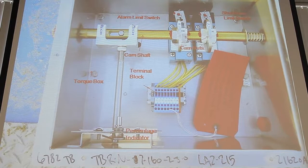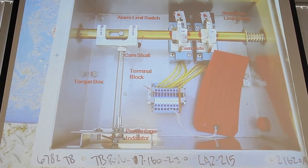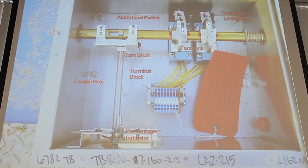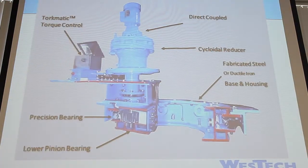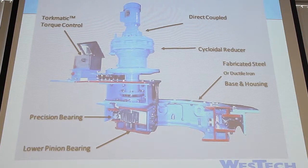It's actually really ingenious. This right here is the rod, and one of the things that we're going to ask the maintenance staff is weekly they go out there and they push this rod. So this rod right here and this rod are connected to the main spring. Now our cycloidal reducer, if we come back here, right here there's a plate. We call this the torque arm plate.